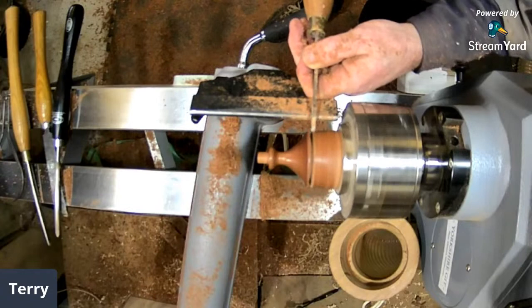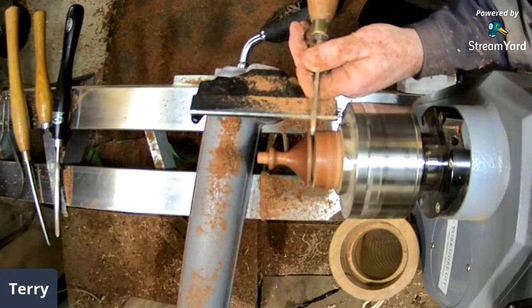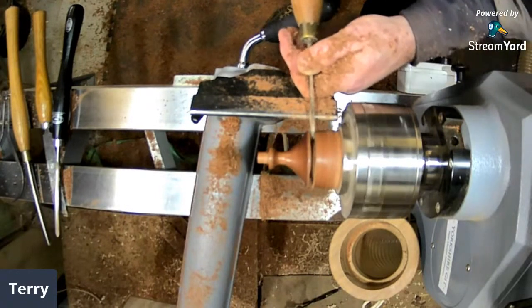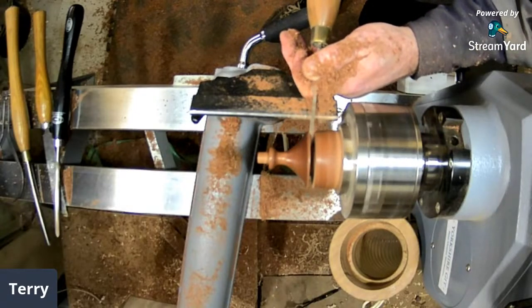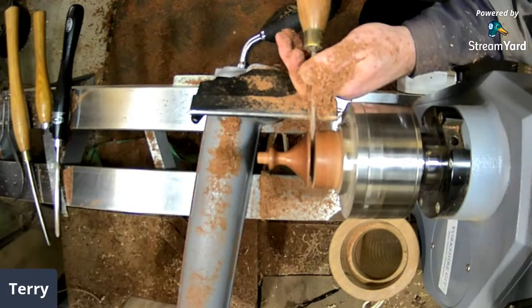And when you're doing it, for those that are new to this, when you're parting off something, always put 2 cuts on each side and undercut the base slightly. That allows the base to sit flush on the table or whatever you're using. And you don't jam the tool as it goes down through.